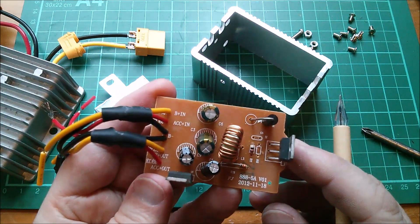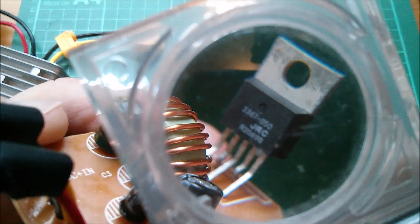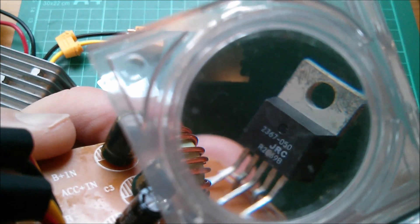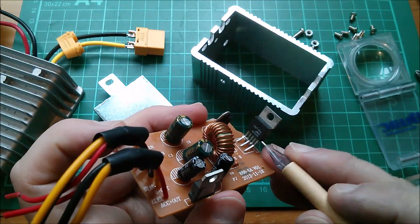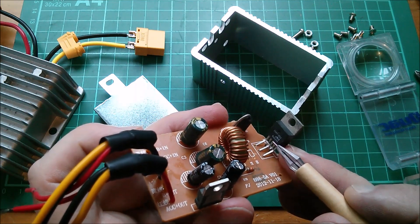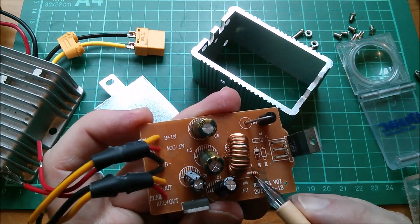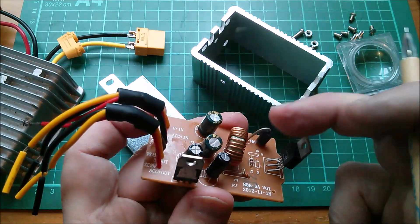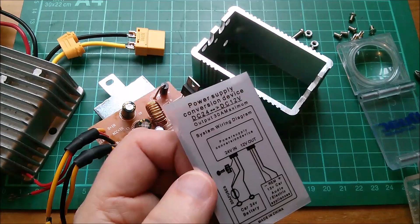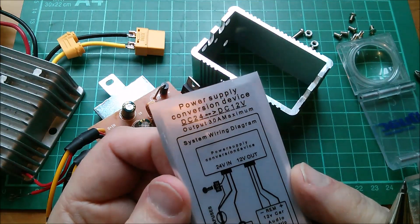A couple of resistors here presumably set the output voltage of the switching regulator. Let's have a look at this switch mode device. It's a JRC 2367-05 - I'll look that one up. This is a 5 amp, possibly 5.5 amp, high power DC-to-DC converter controller with 7.5 to 40 volts on the input. But with a 5 amp controller and a 3 amp diode and noddy wires, this isn't 30 amps. I think there's a missing decimal point - it should be 3.0 amps maximum.